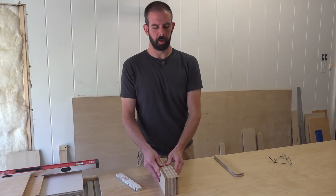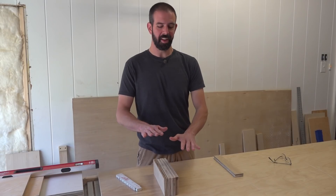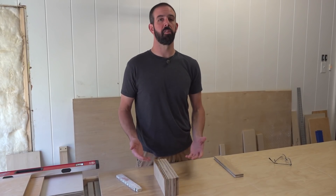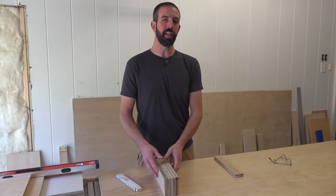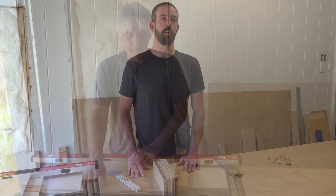And if these are not identical in thickness, you run the chance of running into some wonkiness and you'll start cutting a little here, a little there to make everything end up being the same size, and you're going to end up cutting your cabinet down smaller than you want and may end up having to scrap the whole piece. So by cutting each cabinet all at once, you're going to guarantee as much as possible that you've got a uniform finish across the front.